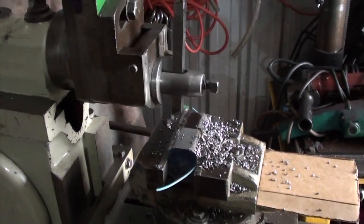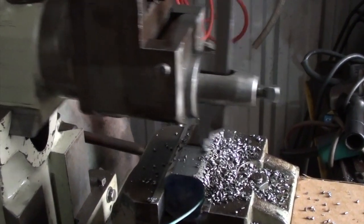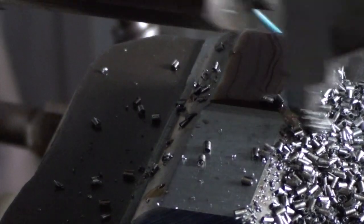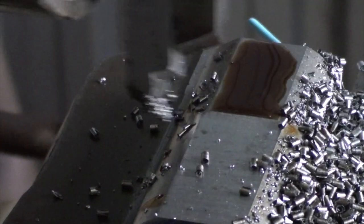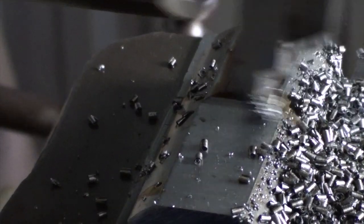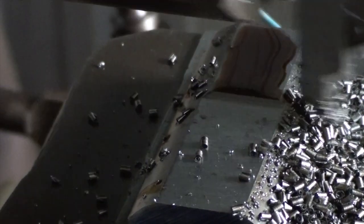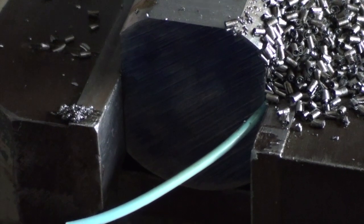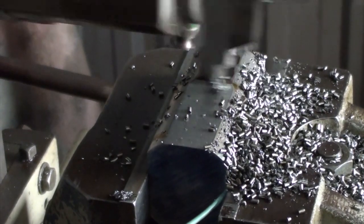I know I should be cutting long ways, not in the shorter direction, but I've got the time so it doesn't really matter. I'm doing around a 30 thou depth of cut, a 5 thou step over. It's working beautifully. I've already squared up two sides, just cutting the bottom in now, then I'll flip it over and square the top off, and then cut the V in.